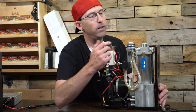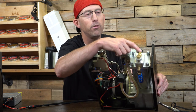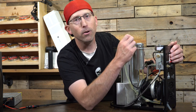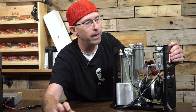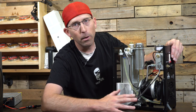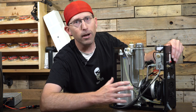At the top of the piston you have the lithium grease pot to keep all seals lubricated, a burst disc as a safety feature, and a second burst disc on the other side — so two burst discs total. The gauge allows for automatic shutoff. Monitor the fill at all times — we're talking up to 4500 psi, which is enormous pressure. For tank size, stick to a pony tank or smaller, and remember your run times: approximately 20 minutes of run time before you need to cycle it off and let it cool down.